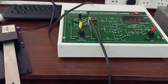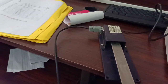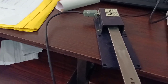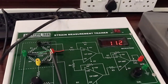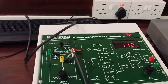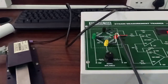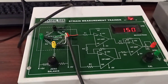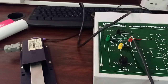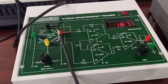That one value difference is because instead of 377 we had done 378 during calibration. I am adding another 100 grams — I am getting a value of 112. I am adding another 100 grams — I am getting 151. I am adding another 100 grams — I am getting 187.